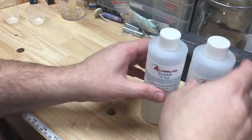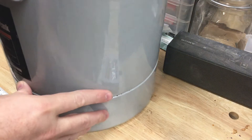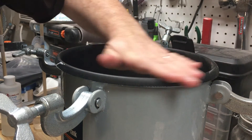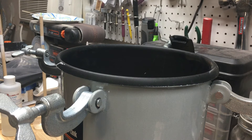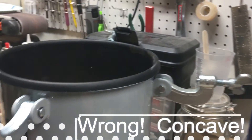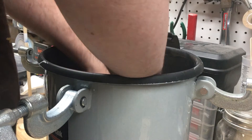I'm going to make some room here — I don't do this often so I don't keep my pressure pot up here. We'll get the pressure pot open. For those who haven't seen this before, this is essentially a paint pressure tank that we've done some modifications to for this pressure process. I'm making sure my O-ring seal is clean so I can get a nice tight seal. I've also put a little disc inside because the bottom is convex and things won't sit properly, so with the mold I try to keep it nice and flat.